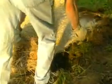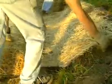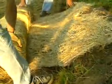Lay out the edge of each blanket with approximately one foot of the blanket extending beyond the upslope portion of the trench. As you lay out the blanket edges, keep in mind that the edges of parallel blankets must be stapled with approximately a 2 to 5 inch overlap as they are unrolled, depending on the blanket type.